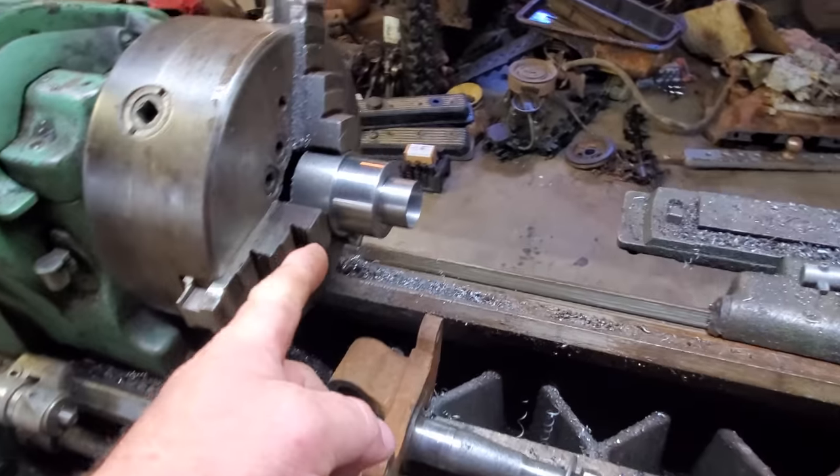Now what I've got to do is this step-down, which is where the bearing is going to sit. It's three-quarters of one inch long. I'll make a mark right here. I've got a backstop over here — it makes the carriage stop at the same place every time. I'm going to line it up right there, loosen the backstop, bring it towards the apron, tighten it up, run it up to it tight, and there I'll have my backstop. Now it'll stop at the same place every time.